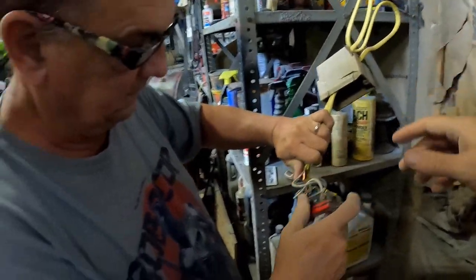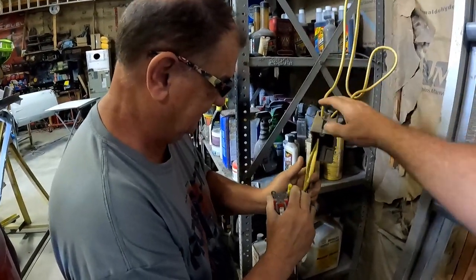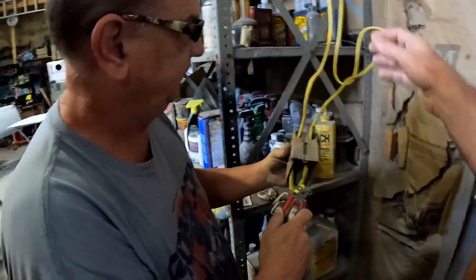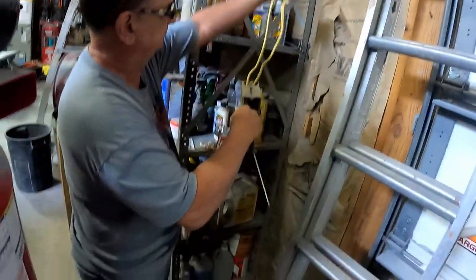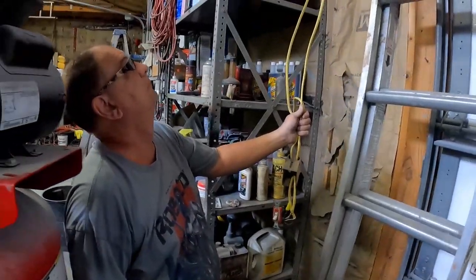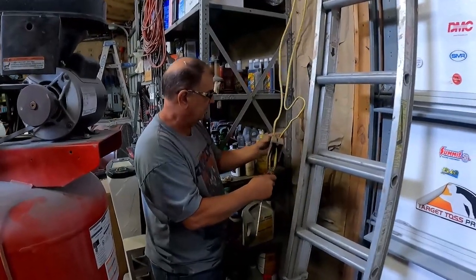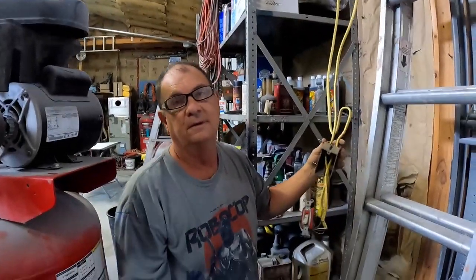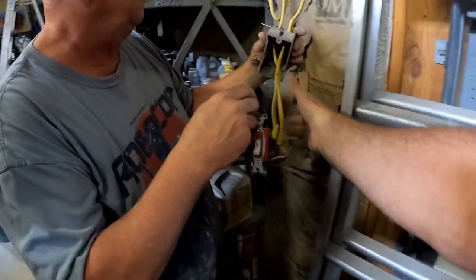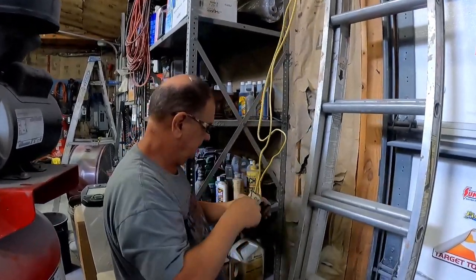We think we should just cut a leg - cut both of these up here past the switch and leave the switch alone. We'll cut the line somewhere and snake that up through the wall, then tie in with something over there. We'll feed it through the box - fish tape, pull it up through the wall, and tie it all in. Then if we can get all of this to go into that switch, we'll see. I'm going to take apart the other switch and see what it looks like.